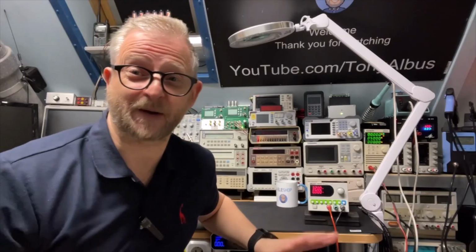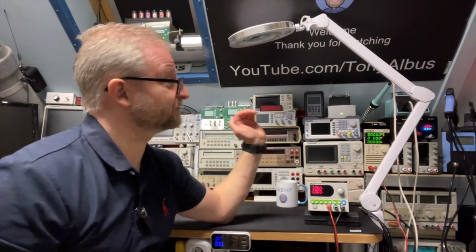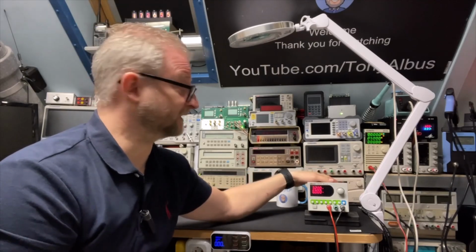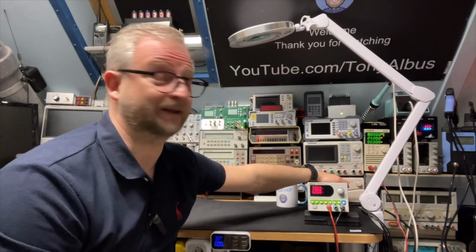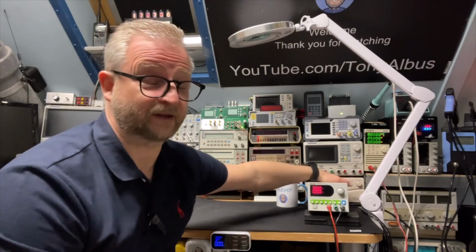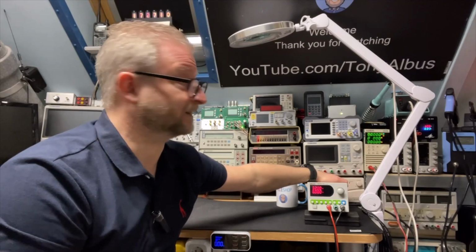Okay, I can say this power supply is super quiet because as we saw, it took like 2 minutes on 160 watts to get the ventilator running, and then already when I took the load off, within 20 seconds, it is already quiet again. So the ventilator is really effective, and it only switches on when it needs to.